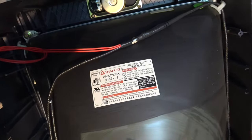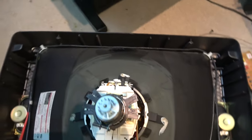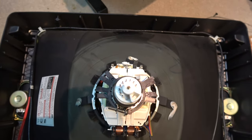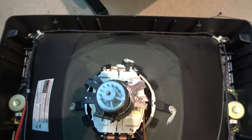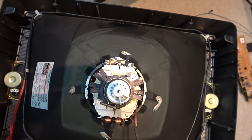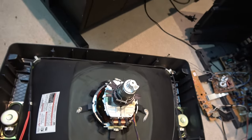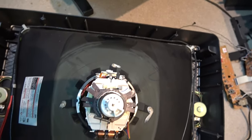The first thing we can see is the make and model. We need to check the number of pins on the neck — counting around: one, two, three, four, five, six, seven, eight, nine, one in the middle — ten. So it is a 10-pin neckboard, and that will determine the type of chassis we'll need. Now I've got to do a few ohm measurements, so let's do those now.